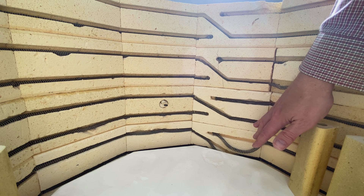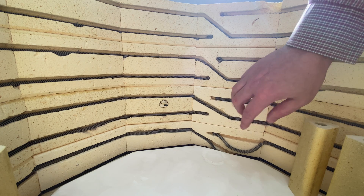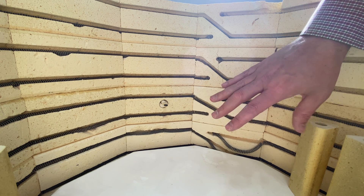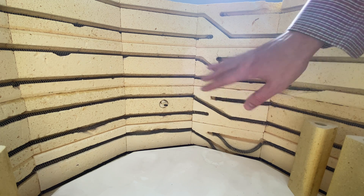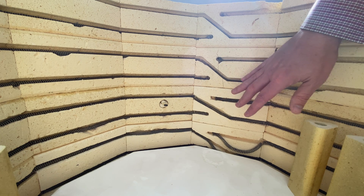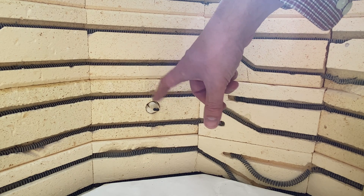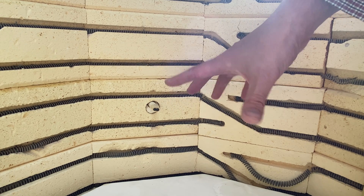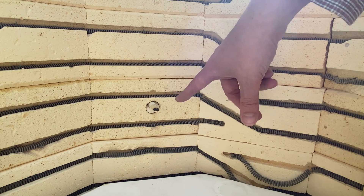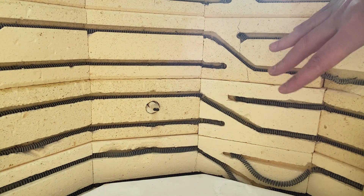This isn't really a problem — you should probably be careful that they don't short out, and the temperature on this particular part is probably not quite even. There's a little bit of a dead zone here, but in terms of overall kiln performance it should have a relatively minor impact. If all of your elements wind up sagging, you probably didn't put them in right, and you might want to think about replacing them. But these elements I got a couple years ago when I rebuilt the kiln have been going well. The thermocouple will corrode because of gases given off during the firing process from your clay body and the glazes, which can create caustic elements that eat away at the thermocouple — it's relatively sensitive to this degradation. But taking a look around, everything else is in good shape.